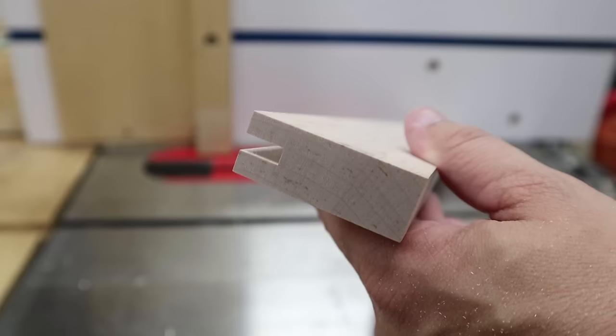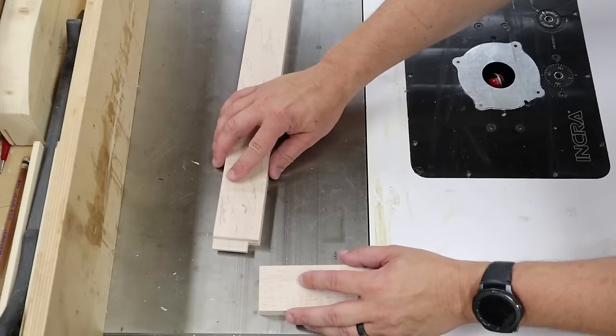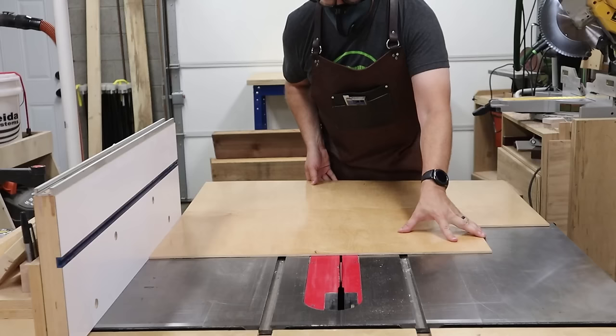As you can see, the tongue should fit perfectly in the groove on the long side of the frame. It's a good idea at this point to do a dry fit to make sure that your frame measures the correct width before you glue up. You really don't want any surprises when you go to install the door and find out that it's too wide or too narrow for the opening.